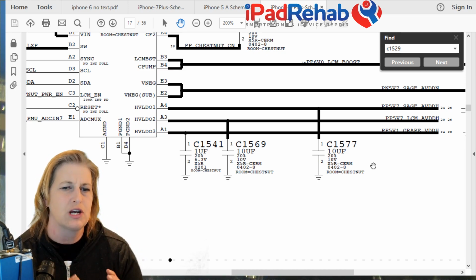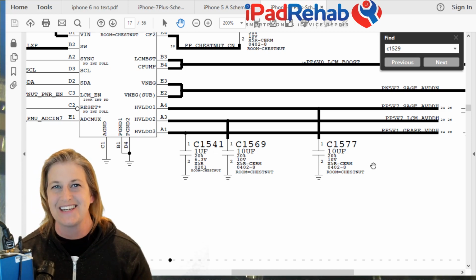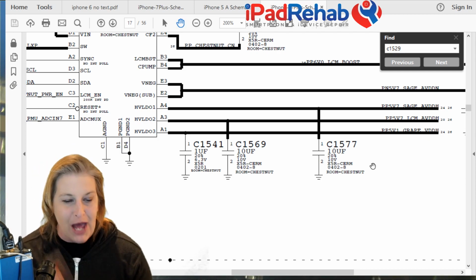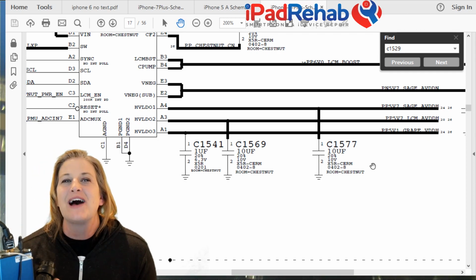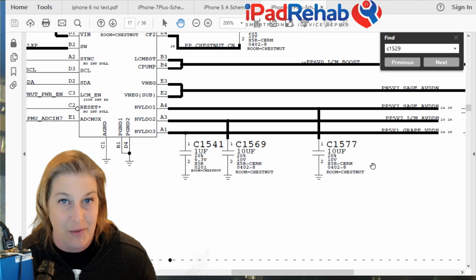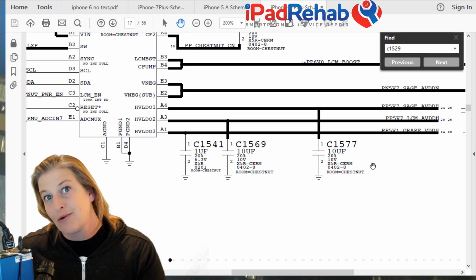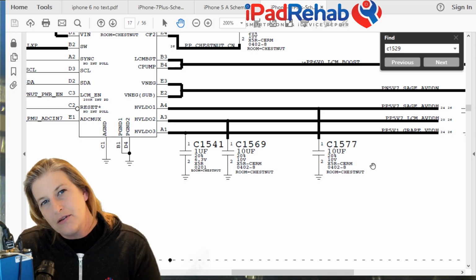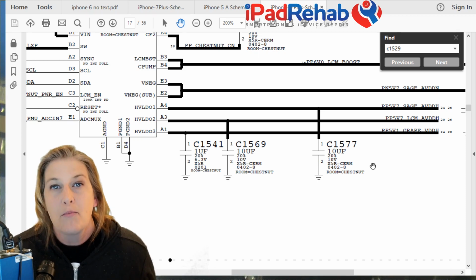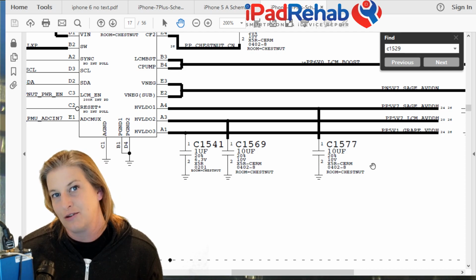So whenever you question a chip, rather than just be like, chip involved with function, change chip, instead of being so caveman, black and white, chip bad, must replace, think about: is this chip being told to turn on? Does this chip himself have a power source? What about his outputs? Are his outputs an open line and therefore just not arriving at the destination? Are the outputs short to ground? Or in this case, is an output partial short to ground? And how would you test? Diode mode. Compare those outputs to a known good port.